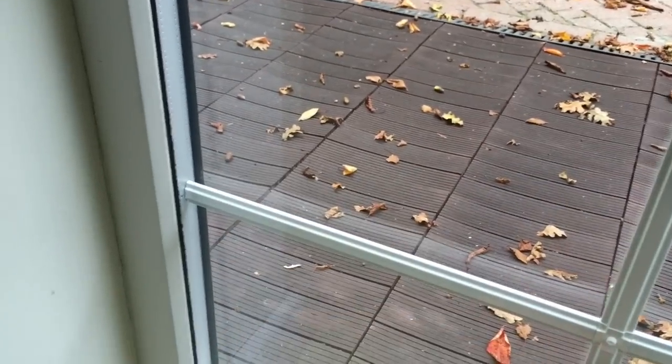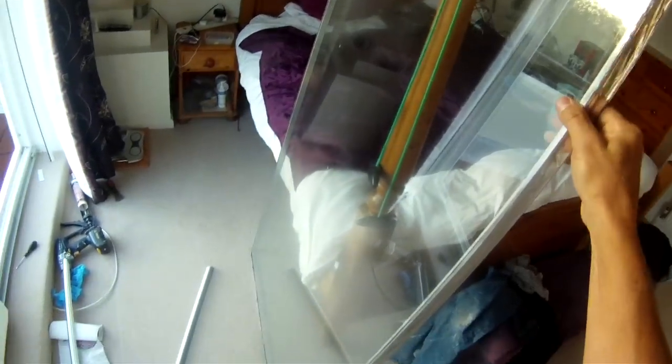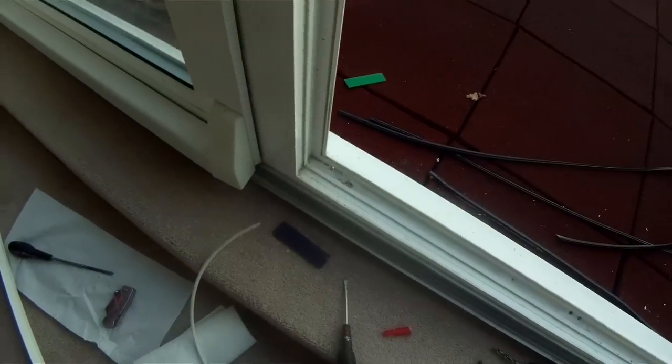You may be thinking what to do with the old massive grey window pane. The easiest way is to take it side-on on the drive, cover your eyes and give it a little tap on the edge. If it's toughened like this one, the whole pane will shatter - wear some gloves because there'll be a lot of tiny sharp bits of glass. Then you can fold up the aluminium sections, sweep up the glass, put it in a bucket or shovel and bag it, and dump it.